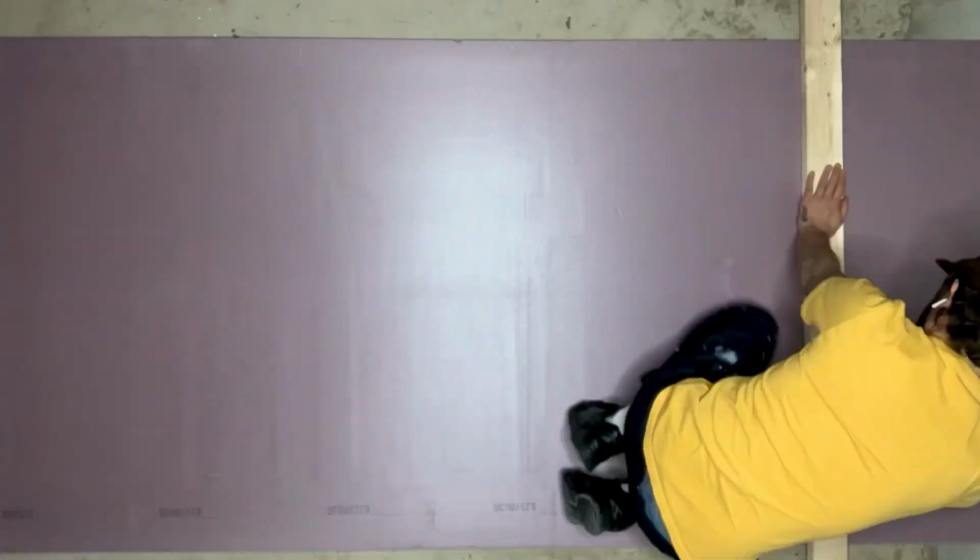That's okay though, I just have to be pretty exact with the dimensions when I cut so that they're nice and tight. I bought 13 4x8 foam board sheets that are 3/4 of an inch thick, which is the same as the boards on the wall to make it totally flush. So that way the second layer of insulation will lay nice and flat. So yeah, I'm gonna start marking out all my dimensions on the foam board and then I can get to cutting. I'm using a utility knife for this since they're so thin.